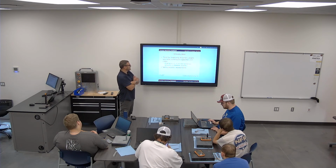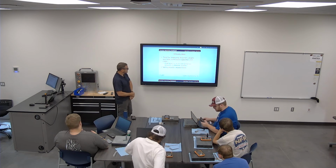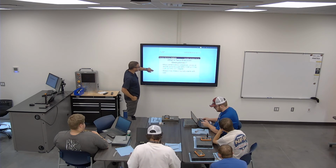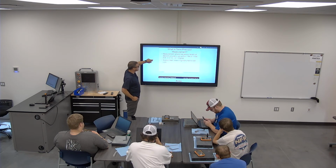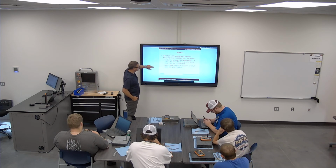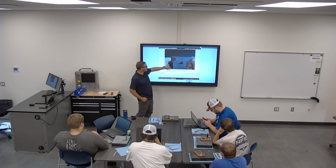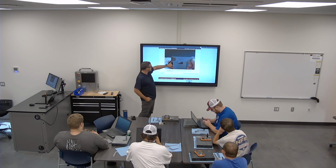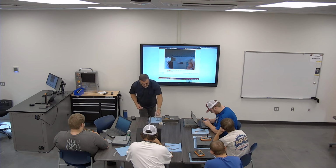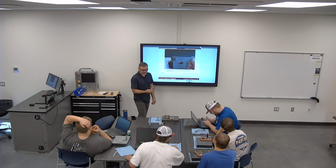Okay. So let's talk about semi-precision measurement. We're about an hour in, and I want to try to get through this so we can be done with you guys for the rest of the week. Semi-precision measurement, we've already been doing some of those things. We're talking about 64ths of an inch. We're talking about measuring in single degrees. If you're in metrology, you're probably getting ready to start talking about the hook rule. This is just a scale that has something on the end as a stopper. If you don't have something like that, you can use something like this to help keep it even as a stopper.